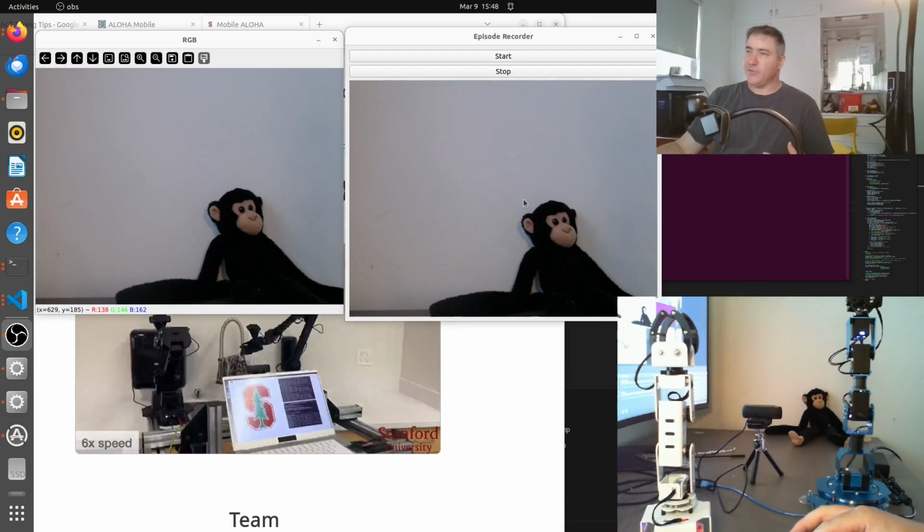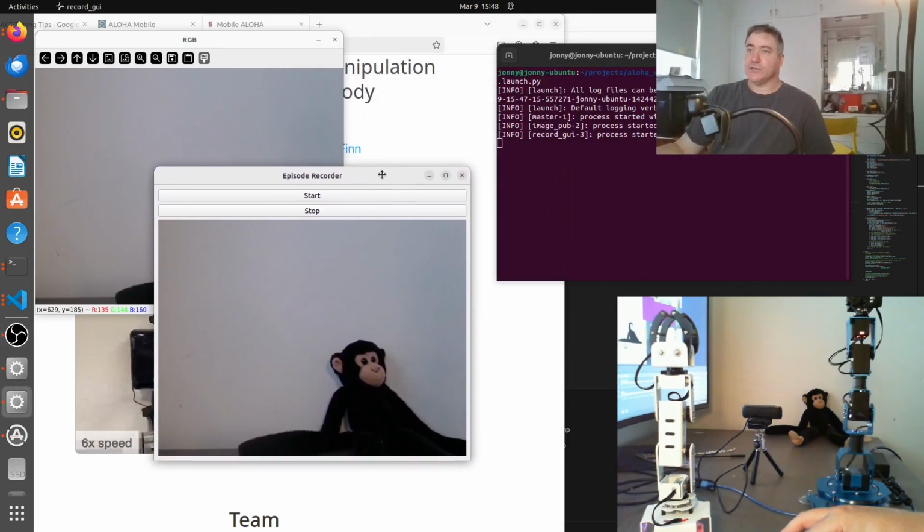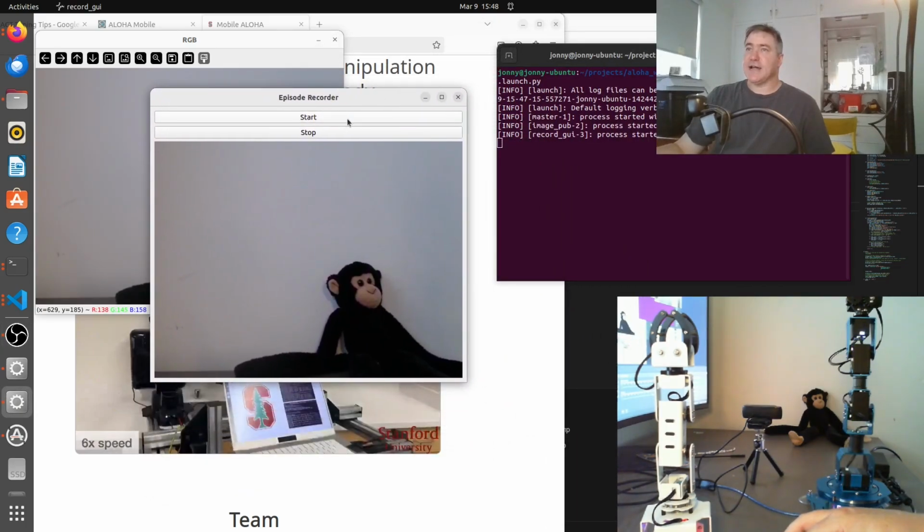The subscriber runs a little bit more slowly because I wanted to bring it into line with this robot arm, because if I send messages to it too fast, you get some jitters on the servo, so I had to slow it down a little bit. So basically when I press start, it starts recording, and when I press stop, it stops recording. I'm going to make this a little bit bigger so you can see it better.